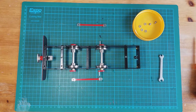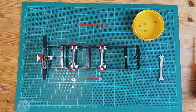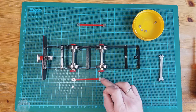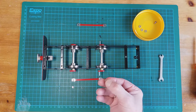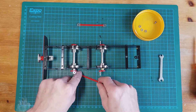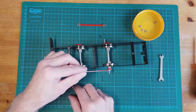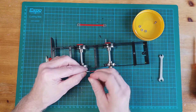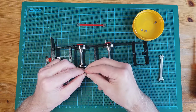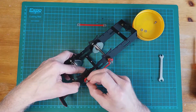We also need the short crank pin for the front — the rear one is already fitted. Between the crank and the rod there is a 5BA washer fitted. We put that on first to the rear, then put the coupling rod on, and then the tricky bit: the short crank pin goes through, followed by another 5BA washer, and then we fit it to the front crank.